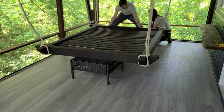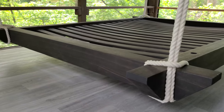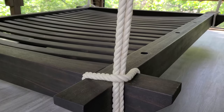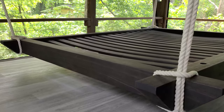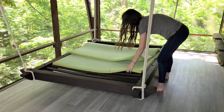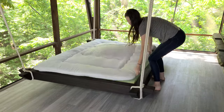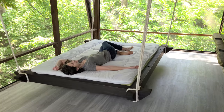Once that's done on all four corners, we can pull the blocks away and we have a hanging bed. Quick tip: hang the bed a little higher than you want it to be. The cotton rope, like what we used, will stretch out a little over time due to having weight on it, so the bed will start to hang lower after a while. All that's left to do now is to make the bed. We start by dropping on a foam pad in our futon. We probably could have skipped the foam pad if we had bought a better futon, but we never bought a futon before and had no idea where to shop or what to look for — thus, the foam cushion.